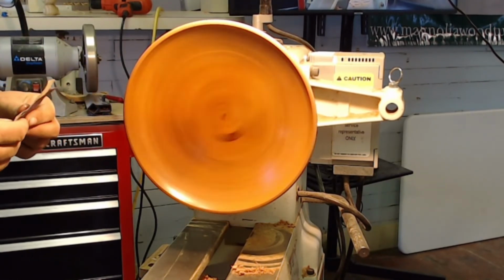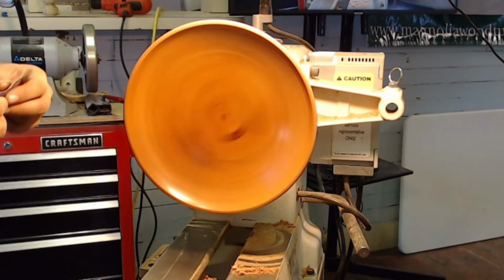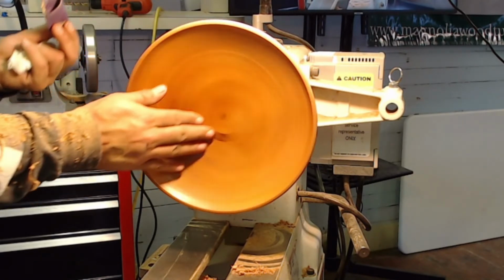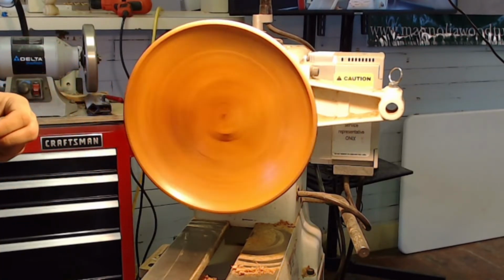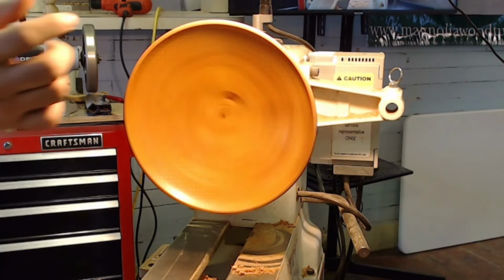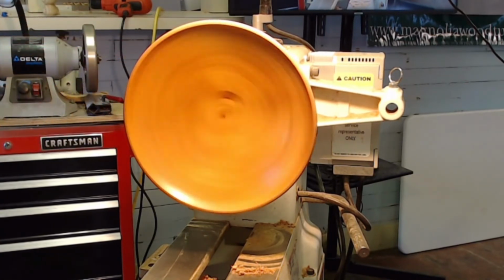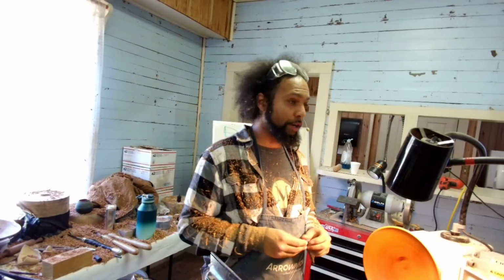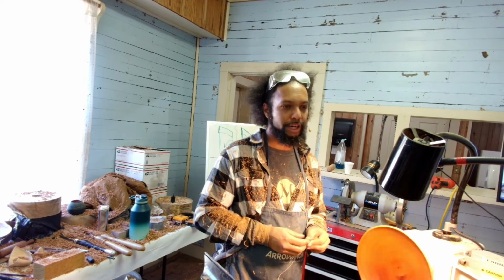You could probably, but the trouble is the dry time. Even if the walnut oil is heat treated, the way Mahoney makes it, it's great, but it'll still not fully oxidize fast enough, so if you put something like a poly in there, I think the finish would go blotchy. So no, not really. For me, this would be the finish that I would use with this. And you'd never want to wet sand with polyurethane. There'd be no real reason to do that. That would just gum up the finish entirely.